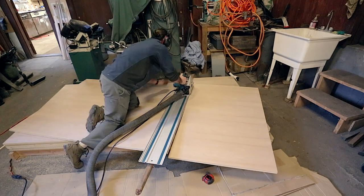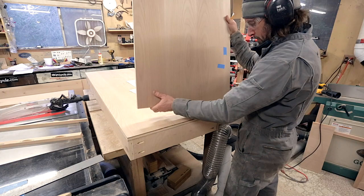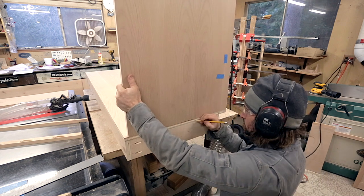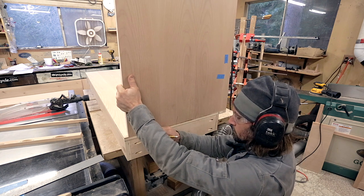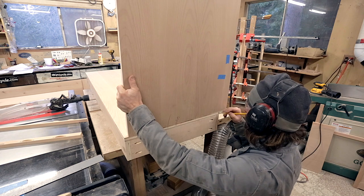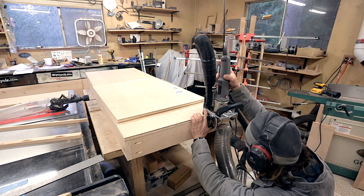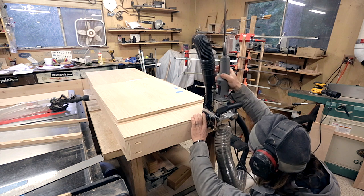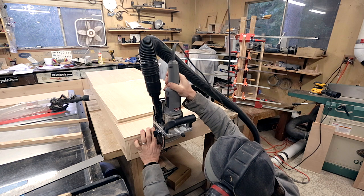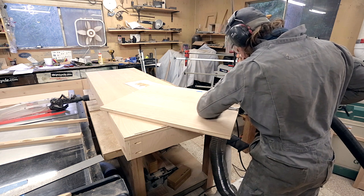I then cut the plywood side pieces. I use the track saw to make the plywood more manageable and then usually do the additional cuts on the table saw. I use biscuit joints to attach the vertical cabinet pieces such as the sides. The side that lines up with the edge is really easy to cut — I don't have to do anything fancy with the biscuit joiner. I first place the piece where I want it, mark off various lines to add four or five biscuits, and then cut them out. The portion of the biscuit joiner that moves up and down is called the thickness plate, and I set it 90 degrees from the face of the joiner. I align the thickness plate on the previously marked lines to ensure those two portions line up properly.